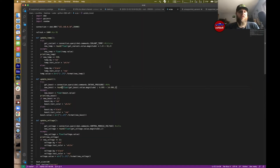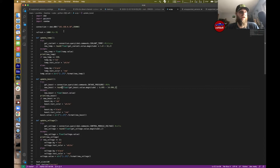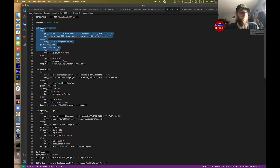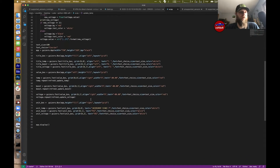After I did the initial tests and validated everything, I decided I wanted to actually build a little bit of a user interface for the device that I could run potentially on a Raspberry Pi in the future with its own little screen. So I built an app that actually uses a GUI — I can fire up X Windows, and I did this using Python's GUI Zero, the Raspberry Pi very simple UI library. Every one second I just get updates to all of those different things. I wrote little definitions for getting the temperature, getting the boost, getting the voltage out of it, and then I built my little UI.